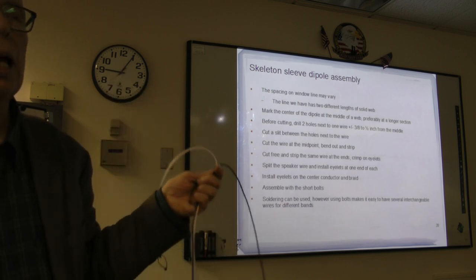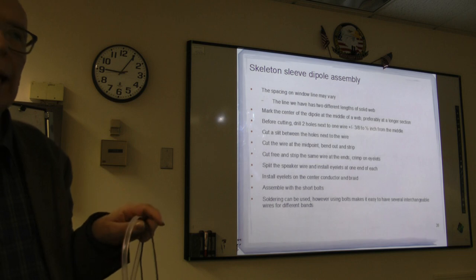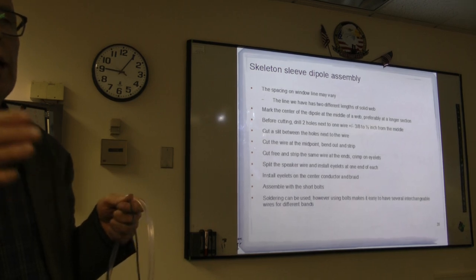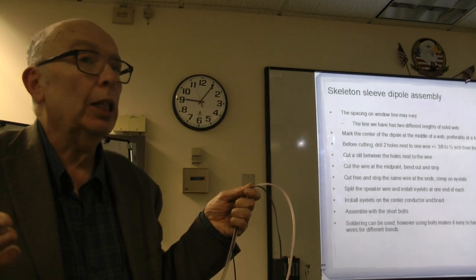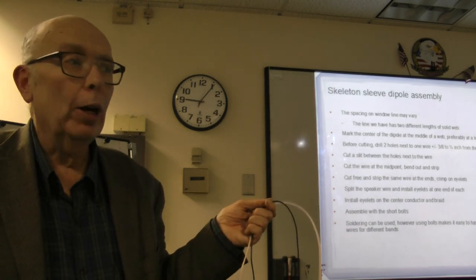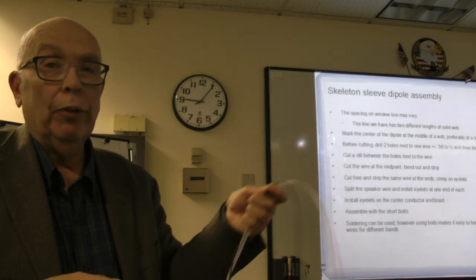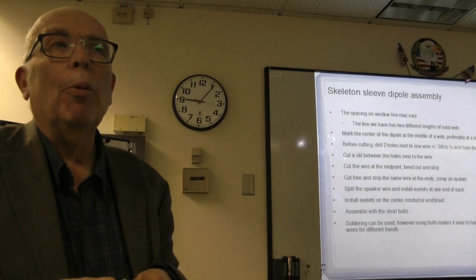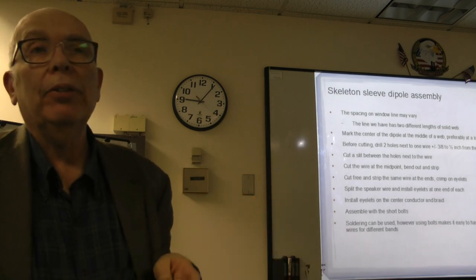What happens is, it modeled, and it was a small fraction that the SWR was good. In my models, I was hitting, depending on which one, around 440 on one and 450 on the other. In reality, you'd have to measure it, and unfortunately, I don't have the fancy MFJ to measure 440. I have the regular MFJ here, which is great for 2 meters. So theoretically, yes. In the model, it was showing a lot of energy going up. Whether in reality that would be the case, I don't know.